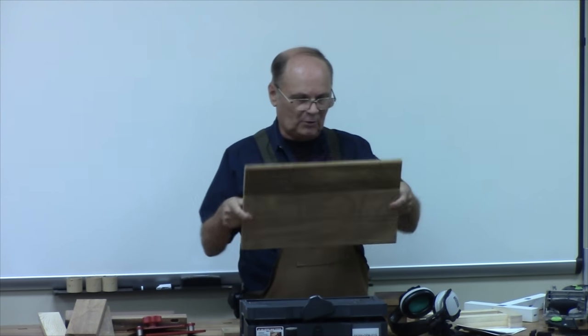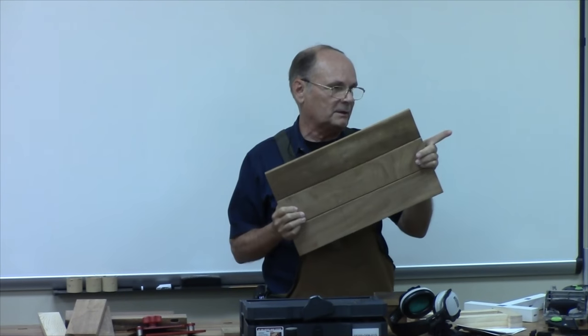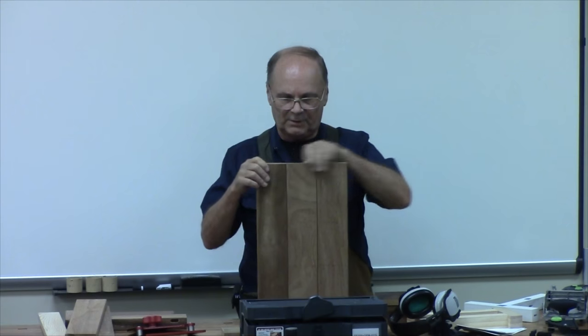Anyway, this is using the hardwood, and it's got the same 10 millimeter connectors as the bench does. This one you can probably pry apart if you want to look at it, but it is a nice tight fit. Because it's surplus wood, I didn't run it through the planer other than to clean it up a little bit, so the boards aren't necessarily flat-flat, but it would be for outdoor furniture anyway.